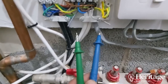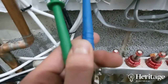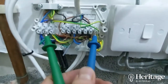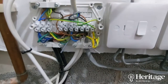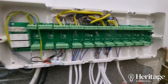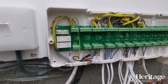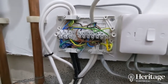I've got my trusty multimeter here on continuity. I've just linked out what I presume to be this cable - the CPC and the black core upstairs - and we need to make sure we've got continuity there, which we have. I've also checked CPC to the brown core, just to double check, because with heating control stuff sometimes it's a 230V signal and sometimes it's 12-24V, and you don't want to be mixing those up. We've come to many of these panels before that have been blown to smithereens because voltage has been put onto the wrong contact.